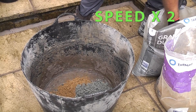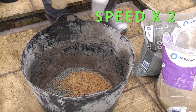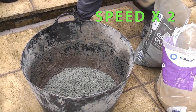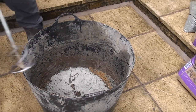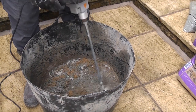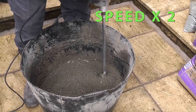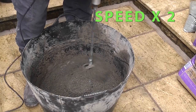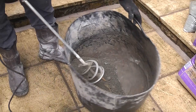So let's get a mix on. I'm adding the correct ingredients to the tub by carefully measuring them out. You will notice the separate container for the cement. Add all of the ingredients to the tub and give it a really good mix until you get a uniform colour. Sometimes you need to lift the tub at one side and give it a bang to prevent clumping.